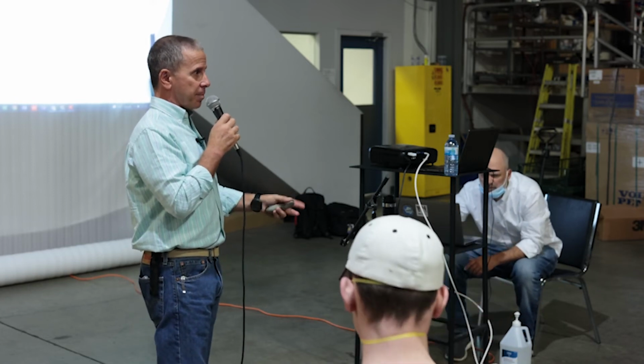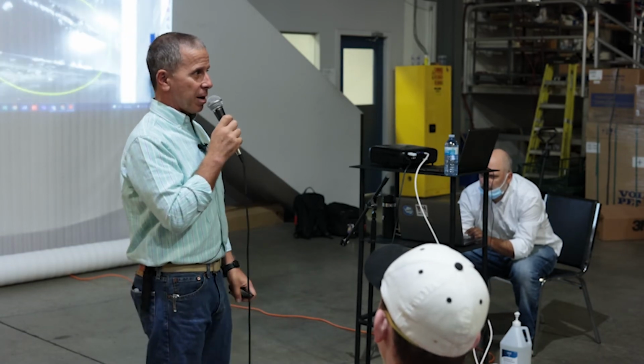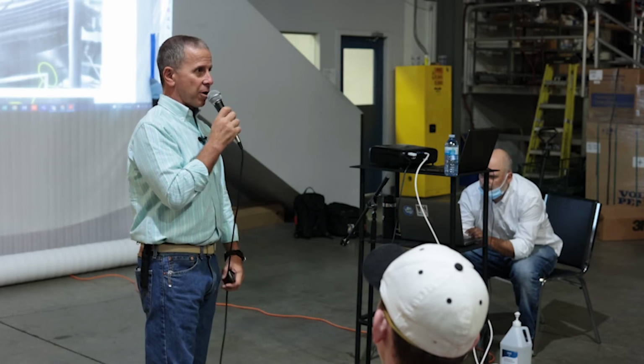Etching primers deal with that fairly well, but if there's enough of it, sweat, same thing. And any of those foreign materials that are on aluminum before it gets painted can potentially create a paint failure scenario. So you need to treat it like once it's ready to be painted, it's sort of sterile and shouldn't be touched if you can help it, or dripped on with sweat or anything else that's foreign to it.